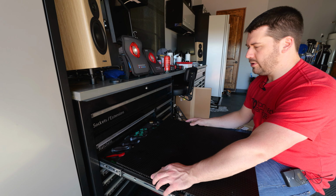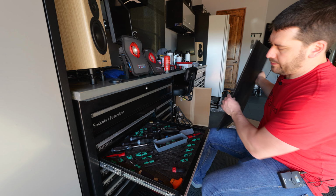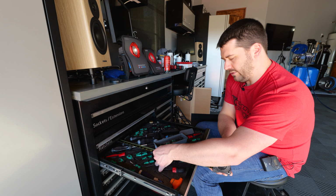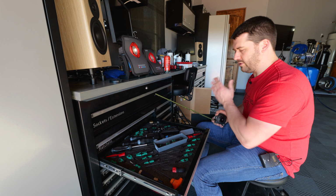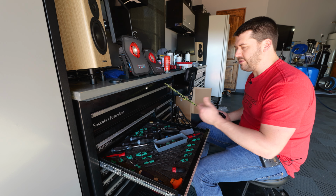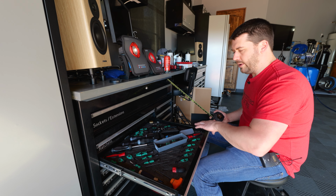So to start off, you want to measure the drawer and cut the sheet. Now in my case, these sheets are 24 by 26. The drawers are 22 wide by 19 deep. So generally what I'll do is, it's 19 3/4. So generally what I'll do is I'll cut the 24 down to 22, and then I'll cut the 26 down to 19. That way the piece that I get left over is 7 inches deep by the whole width of the drawer.